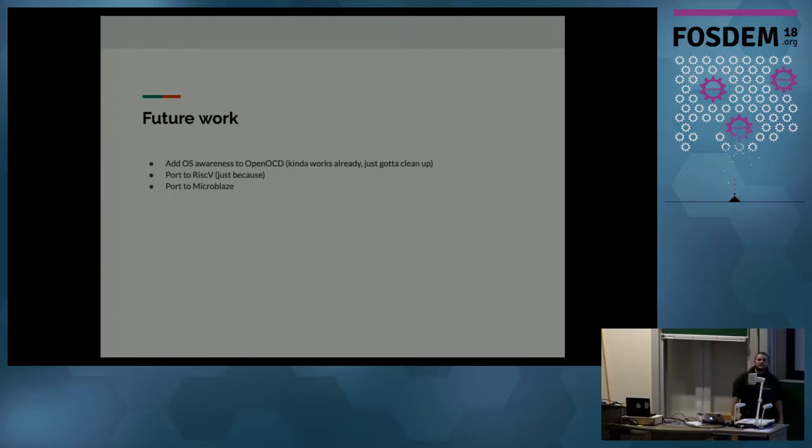With the SysTick, I didn't write that code, right? I adapted it, so I used what they did because that worked. I thought about why they don't use the SysTick, and I think it's because they're doing this timer compare unit thing where you set the timer compare to the next deadline while you keep the timer running continuously. So that gives you a continuous time base plus finer grain control over shorter deadlines in one thing.